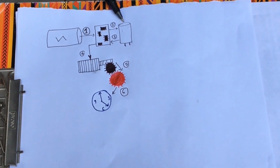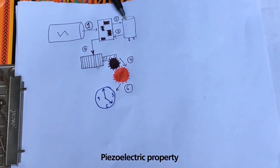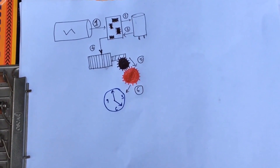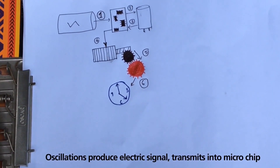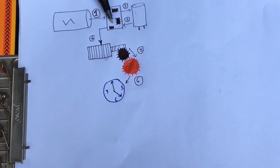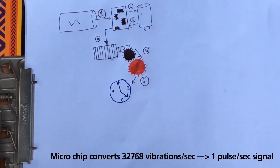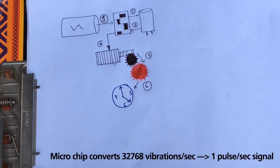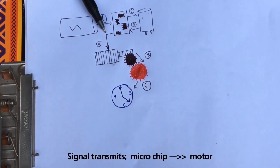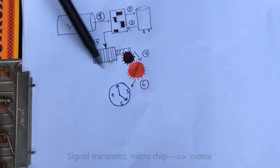This piezoelectric crystal, by virtue of its piezoelectric property, transforms its own oscillation of frequency 32,768 per second into a small electric signal and delivers it to the microchip. This microchip transforms that electric signal into a general electric signal of frequency 1 pulse per second, and that signal is then transferred to the motor.